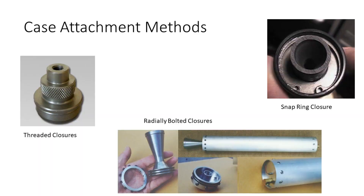Because I want you to be able to easily replicate this at home, we're going to select a different method of attaching the end caps. Small experimental rocket motors often use snap rings to hold the end caps in; however, this requires making your case thicker and therefore heavier. My preferred method for holding the end caps in is called radial bolts.